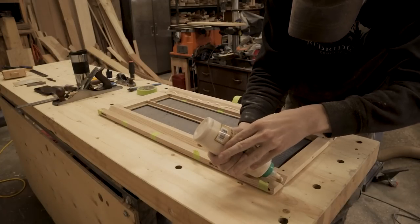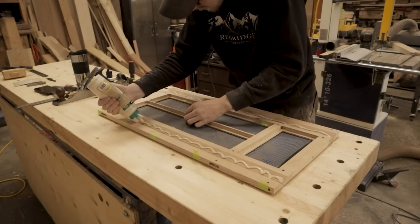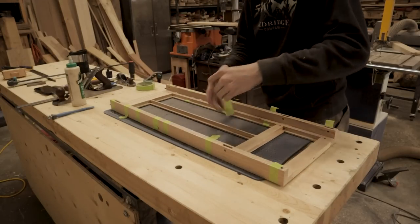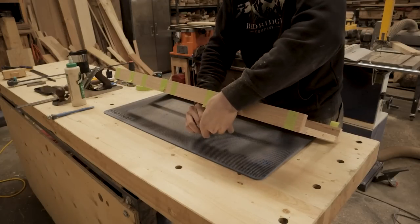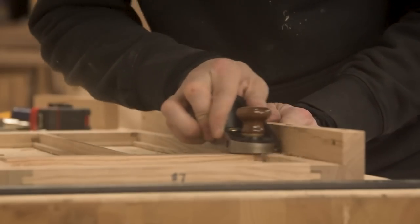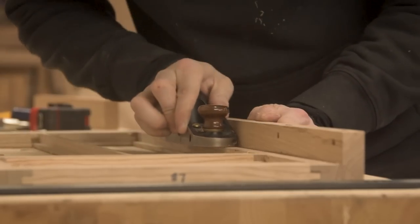So it's built up with this mortise and tenon joinery in the frames, we've got these really strong bevels for our corners, and we're creating this whole structure out of this frame joinery. So it's a much, much different style of cabinet compared to any of the other stuff that I've built before. And I can fully admit that I was very skeptical of it actually working, so I did design it so that it could be a desktop sitting cabinet, you could just leave it sitting on a desk or on a side table, whatever, something like that, but it does have the option to hang.